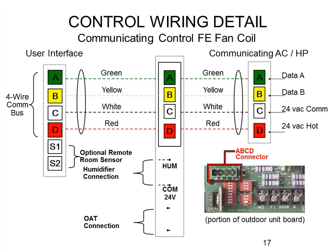The outside air sensor is built into the outdoor condensing unit. If it's not and you order one optionally, you wire that to the terminal strip on the furnace. The humidifier also wires to the furnace — the humidity sensing happens at the stat, but the actual relay clicking action happens at the furnace itself. You may or may not need to add an isolation relay depending on the specific humidifier; some newer Bryant humidifiers have one built in.